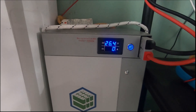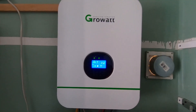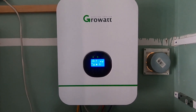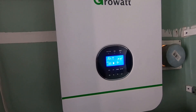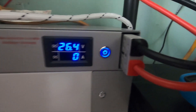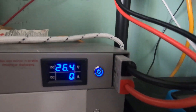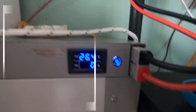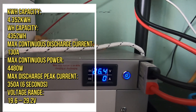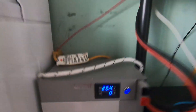That's why I went with the BigBattery bank — it's a LiFePO4 battery bank system and it's been really really nice. The instructions are pretty clear and concise. Make sure you use four-gauge wire — the thicker wire — from your battery bank. This battery backup system is nice because it comes with the higher gauge wire that you need. I believe you can draw up to 250 amps off of this bank, but don't quote me on that — I'll post an update. It can handle pretty much everything I've thrown at it so far.